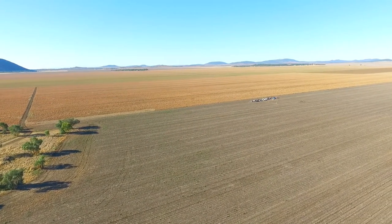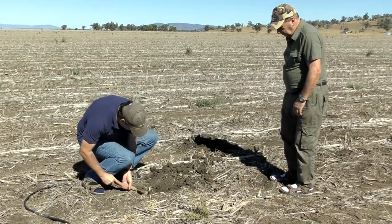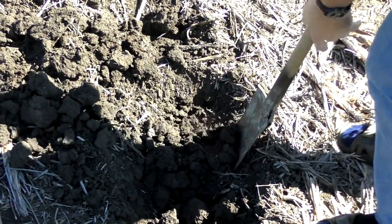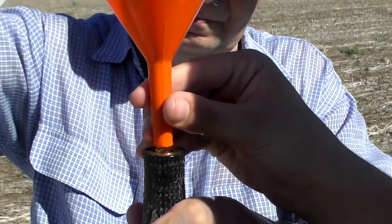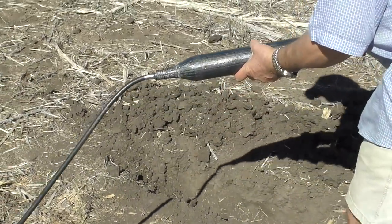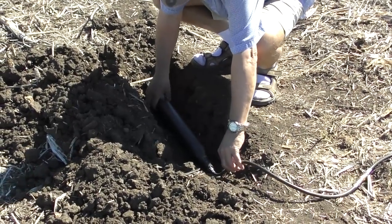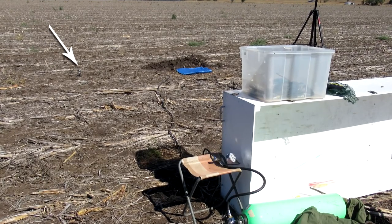Let's have a look at the pressure tests. We actually performed these tests at Mullaly during the launch in May. Since there was a possibility of blowing these up, we first dug a hole in the ground to help contain some of the shrapnel — and socks and sandals are standard issue on the test range. We filled the pressure chamber completely with water, then attached the high pressure hose at one end, and put the pressure chamber in the hole. The rocket box served as a blast shield, Dad was behind it with a steel helmet, the scuba tank was there so he could control it, the pressure gauge was on a chair, and we had cameras set up including a GoPro to capture anything that went boom.